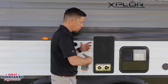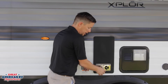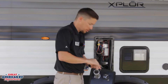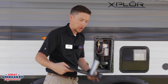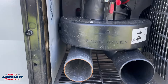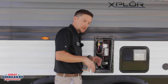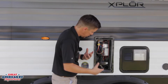Let's go over a few components. We'll go ahead and remove this cover and exhaust plate off of here — they have four screws here and six screws here for the exhaust plate. Once we pull our cover off, we can see we have an insertion tube right here that goes around and sleeves around the tube for our exhaust. We want to make sure when we put that back on, it goes on properly and it's nice and sealed. Down here, we have our exhaust burner tube. All of this will get very hot whenever that unit is running, so be mindful of that whenever you're out here on the exterior enjoying the patio area.